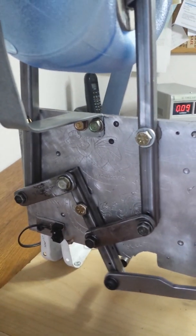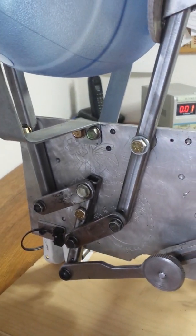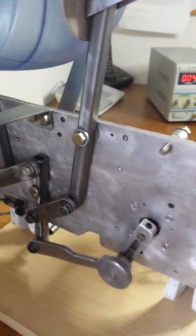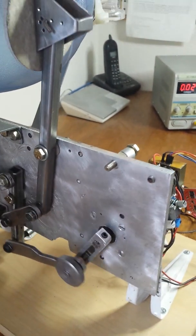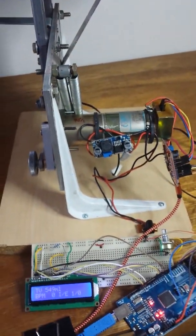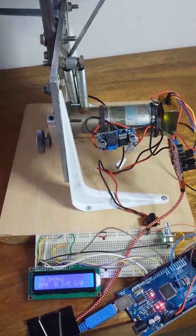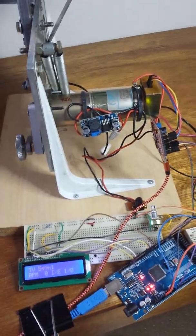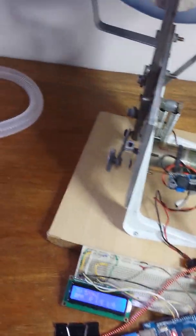And again, it uses a homing switch. Once it reaches its max limit, it sets it to 0. And then it will go to the position commanded. It's a closed loop position control. So very precise, fully programmable. If I can get a physician to give me some more info on how they would like it programmed, it can easily be done. And we're working on incorporating a pressure loop feedback that can be directly hooked up to one of the masks.